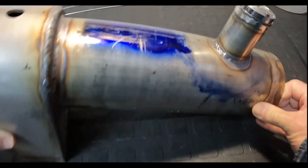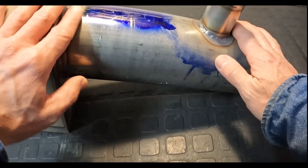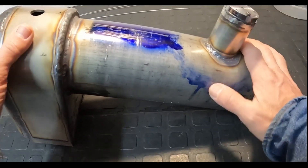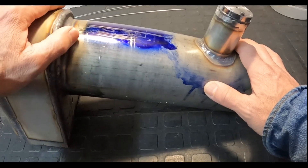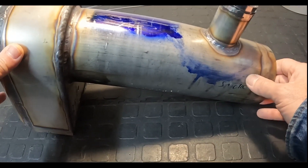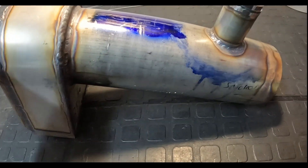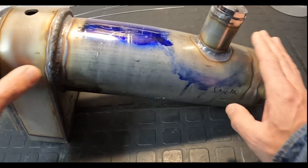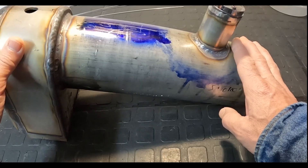That finishes off the boiler series. I do my boilers very differently to the normal model engineering approach, and I hope it catches on. These stainless steel boilers cost between 20 and 30 percent of what a copper boiler costs — much cheaper, much easier to make, and no risk of burning yourself heating up copper components for silver soldering. For larger boilers of 10 or 15 liters, I'd recommend steel boiler plate, but for these smaller boilers, I think stainless steel is the future for model engineering. Thanks for watching.